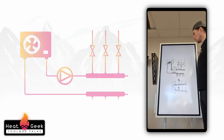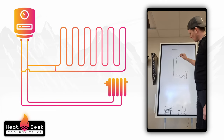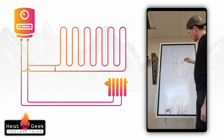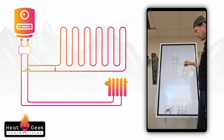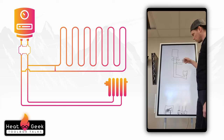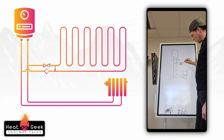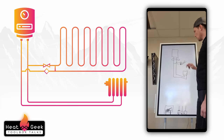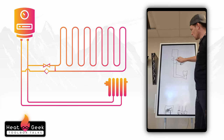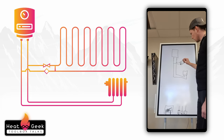It doesn't matter where the zone valves fit because it's a circuit. So if we've got a boiler feeding radiators and an underfloor heating circuit, I generally don't like to put a low loss header in there. If you need different flow rates you could design them for the same flow rate, because I don't want to blend down for both circuits — only for the underfloor. So I suggest putting a zone valve here and a balancing valve before the underfloor heating comes off. Andrew Millwood disagrees with that, and I've got a video planned to explain my theory behind it.